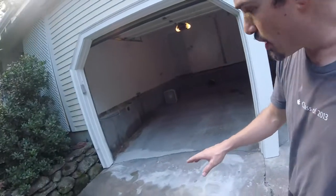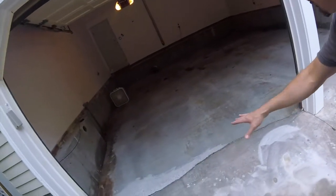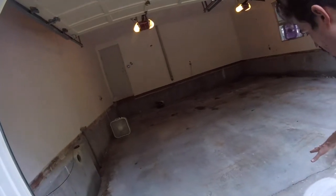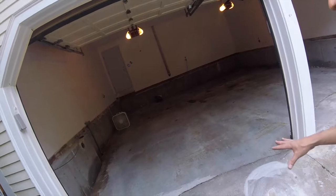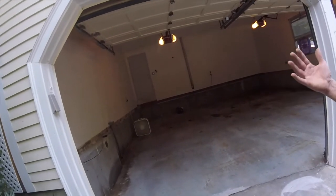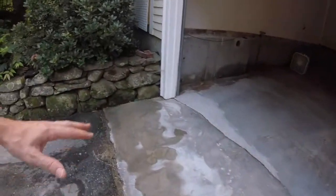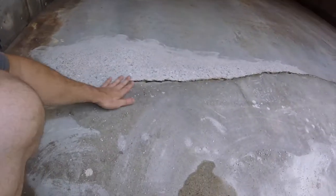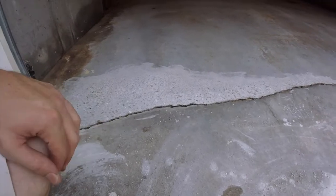The only other little things that we did was we did have this stress crack that was right here. There was no expansion joint put in here, which normally you would see an expansion joint. So the concrete found its own expansion joint because this lip here was basically heaving in the winter. And that's what caused that to crack there, and then it caused it to crack over here. And so that caused a little bit of a lift or subsidence out here, and we basically grabbed a diamond grinder here and we just smoothed that out so that now there's not a tripping hazard or a lip.